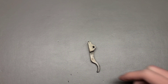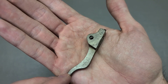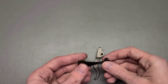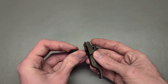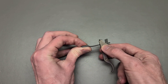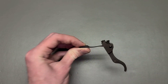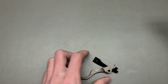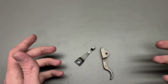So here is a standard Mosin-Nagant trigger. A lot of you will recognize this particular one from our EvapoRust video - this is our Remington trigger, cleaned up really nicely. Basically, the way these work is that you take your trigger spring, which goes through here, and this screws into the receiver. Then there's a little pin that goes through here that holds the trigger in place. This right here is your sear, and when you pull the trigger it drops the sear, which engages with the cocking piece, drops that, and the cocking piece goes forward and fires off a round. This is a standard trigger used pretty much by every single Mosin-Nagant variant - basically interchangeable.